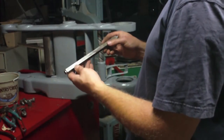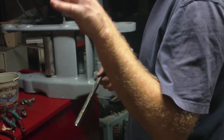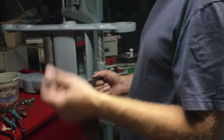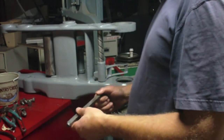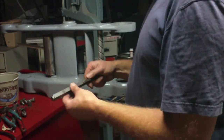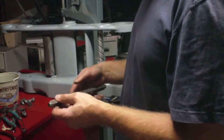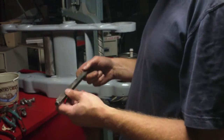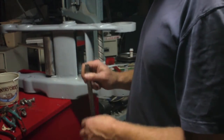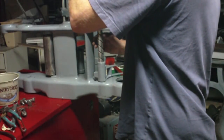And I just tried using my wire wheel, and it's kind of hard to use this to clean this on my wire wheel, because on my grinder over there, I've got the grinding wheel on one side with a rest and the guard, and the other side was missing the guard when I bought that, no rest either. So I'm kind of holding it freehand, and it's a little grabby, and it's taken a long time. And I know that if I take this outside and use my angle grinder with a bristle disc, these will probably clean right up real quick, come out a lot better. So I'm going to do that next time I work on it, when I have some time during the day.